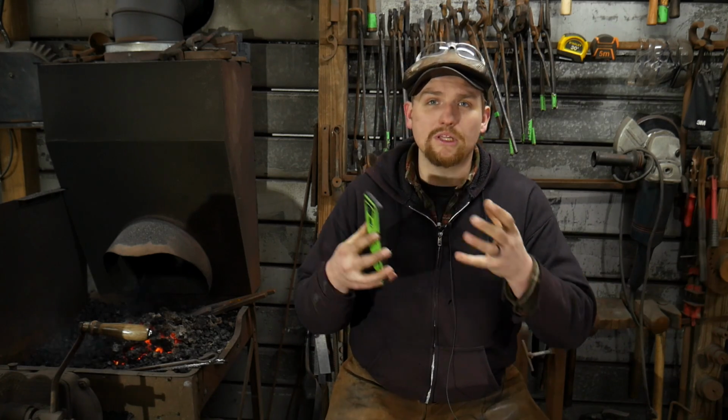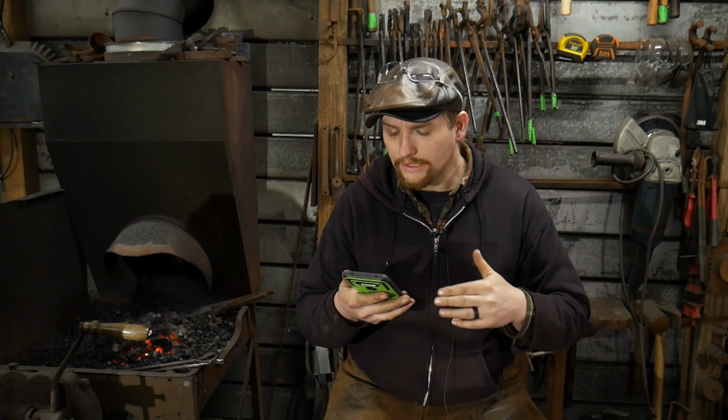It is not a sugar coating. It's not a plasticine. You're not wrapping it in a blanket of flux that prevents all oxygen from getting to the surface of the steel or the material. It may have a little bit of benefit that way, but using too much flux will end up causing your welds not to stick. It will actually inhibit it because you've got too much of a layer built up and you could never whack it hard enough to get down to the unfluxed layers that are supposed to be molten.